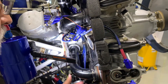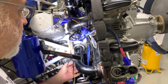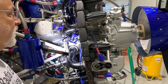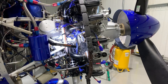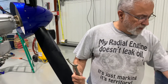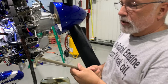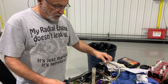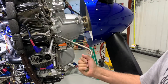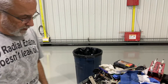The air off of the induction pipe that goes into the cylinder for the fuel — as you can see, there's a special ring nut here that goes into the supercharger housing, and a person needs special tools to get that particular job done. The M14P is a great engine, but there are just some tools that a person needs to have. This one here takes off the exhaust rings. This tool here is the one we use for putting the induction tube back into the supercharger housing, and as you can see, these are all specially built. This particular wrench is used to take the nuts off that hold the cylinder onto the case. If you don't have some of these things, you just can't get the job done.